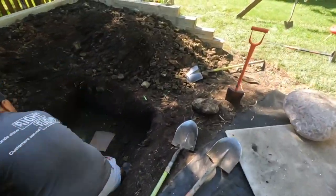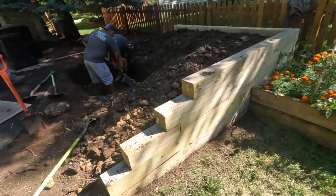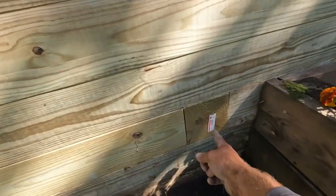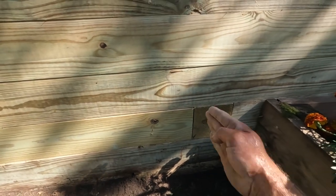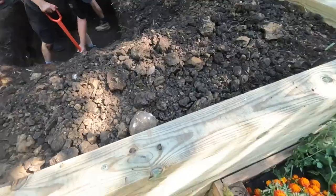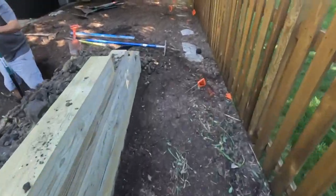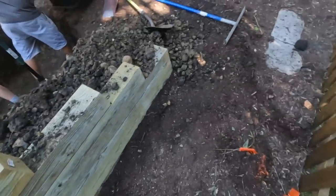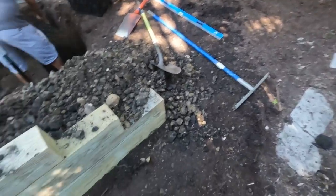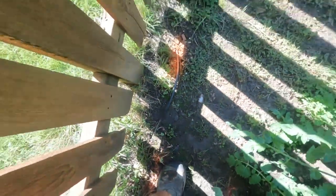We're throwing all that dirt back up against that beautiful retaining wall that unfortunately you'll never see, but it is bombproof. JD and Dan have a carpentry background so you can tell they pay very close attention. This six by six right here is a deadman going back perpendicular into the hillside — it runs all the way back and will help keep this wall in place and nice and plumb. Coming around to the back side, here's that walkway we wanted to maintain for access through here. We also had some utilities in through here — looks like phone and cable lines buried in this area. You always want to be careful because utility lines are very rarely much further down than you'd think, and some are barely buried at all.